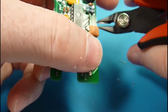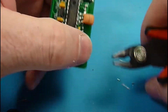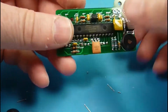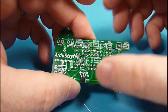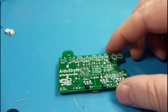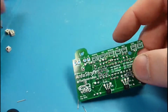And put those guys down. It's a little unusual to have components on both sides in through-hole kits. You see it all the time in surface mount components, and in this case, it's a special circumstance because we're trying to tuck a lot of this away from the action, but we do need a few pieces up here so we can measure the clip being inserted, and then we're going to have all our wiring come in for these connectors, which is really the last piece we have here.